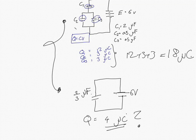You're right. You both have the right idea. The point is this. If I have 4 coulombs here and 4 coulombs here, that does not necessarily mean the total is 8. So what I did in the first one is not the correct total. It actually is 4. And the reason, like what you're saying, Cal, is that when the first charge moves into the second one, it doesn't behave simply like 4 plus 4. So if you want the total charge, it's much better to get the total capacitance first. Then from that, you can get the total charge.